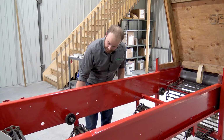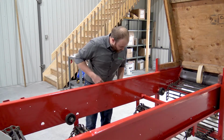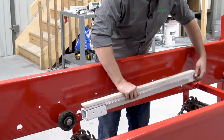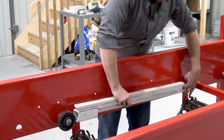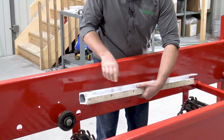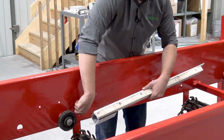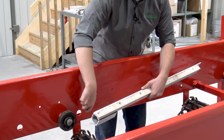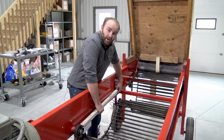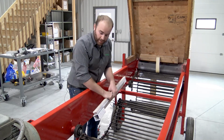So we just took a hole saw and took the two holes here. We just took a regular drill and put holes here. I took a roller off back here so I can mount the slide mechanism we made. So the slide is going to pivot on the roller back here when we attach it all. And it's going to be bolted on this end to the load cell here with our widened hole. So it's going to sit on the roller and pivot on top of the load cell, much like a trap door almost, and the load cells will see all the weight.